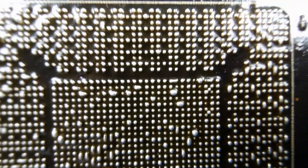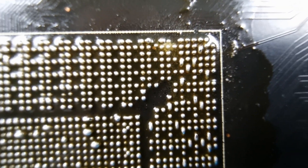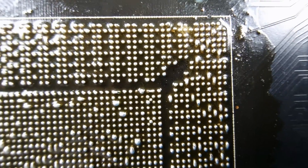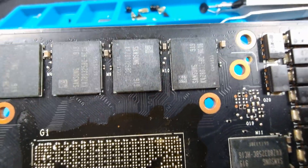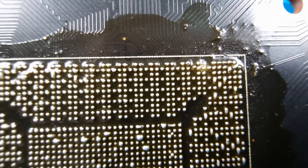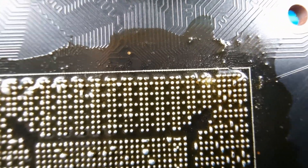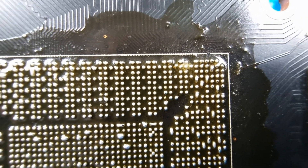The main reason is to check and see how everything is under the core, because a lot of times if you have memory problems it could also be related to the GPU core — not necessarily the memory chips. You see those data lines coming from the memory chips? If you follow them, they go under the core and they're connected to the GPU.